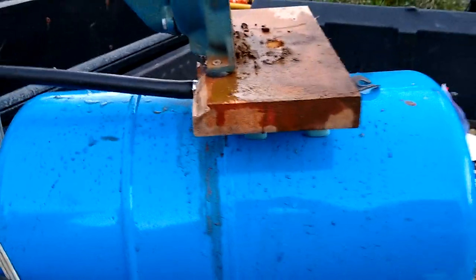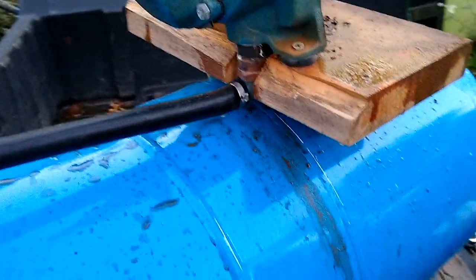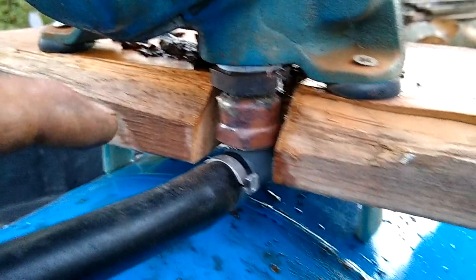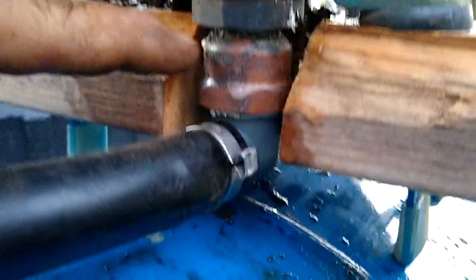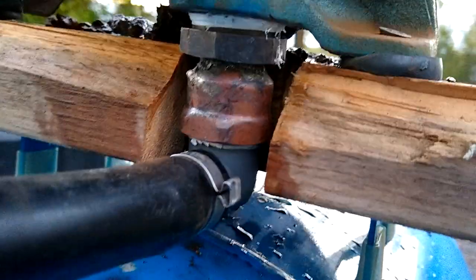Another little trick I did on these: this type of pump usually comes on an upright tank. Well, the upright tanks are kind of hard to get, so I went with one of these AO Smith tanks that you can get right at Lowe's or Home Depot. But there's a fitting that goes from the pump to the old tank — it's fine thread, so it's not NPT. To be able to get something to thread into it, I had to sweat a copper fitting into this piece of brass — basically a three-quarter inch copper bushing. I think I had to sand it a little bit and then it fit right up in there.